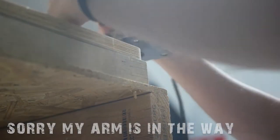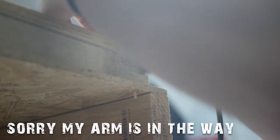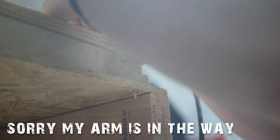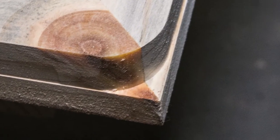To get the rounded corners, I have a corner pattern that I trace, and then using a pattern bit on my router I cut the shape. I then flip the workpiece over, change bits to a trim bit, and duplicate it on the other side.